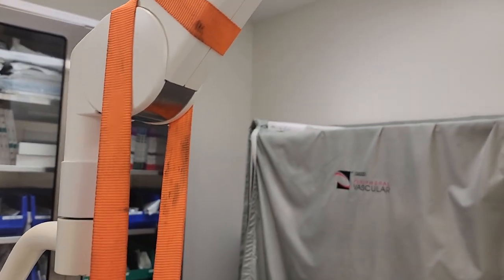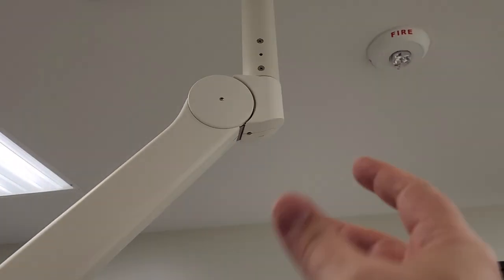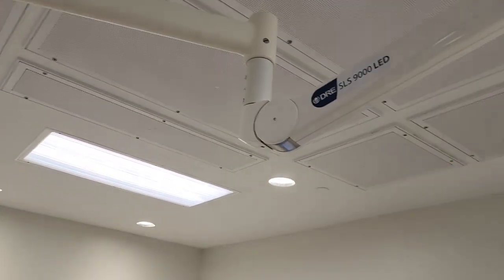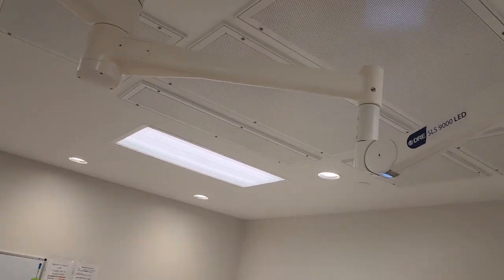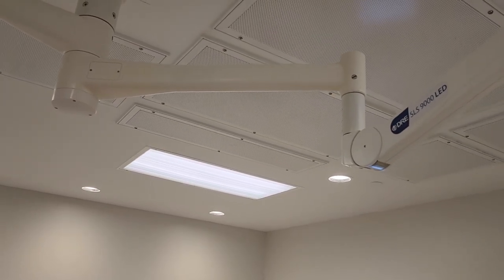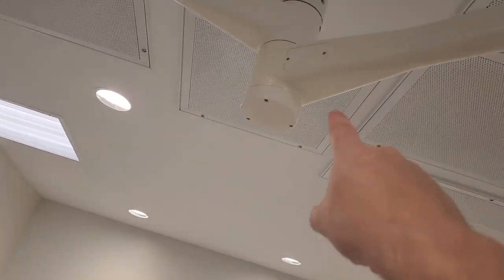Other things to check, you can see right here, I've got my guard plates, my corner pieces are on, my bump cap down here at the bottom is working. There's other things that you should check, like up there, those large flatheads. Those are tensioners for drift, for side-to-side drift. Actually, look at this light right here. In this direction here, it wants to drift a little bit. So, let go, and yeah, see, it does drift a little bit. Not too bad, though. So that would be an adjustment up here.